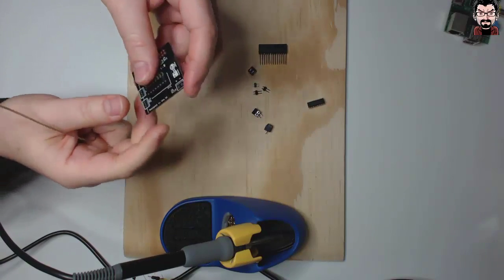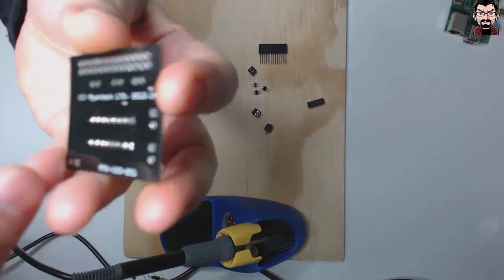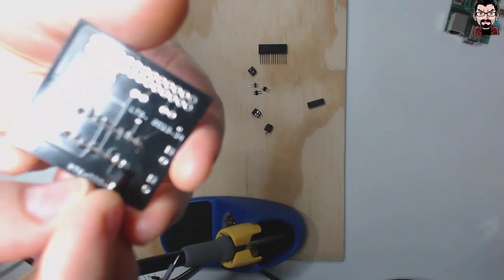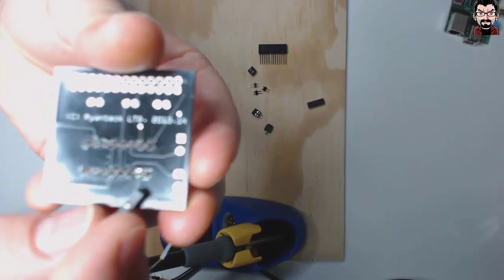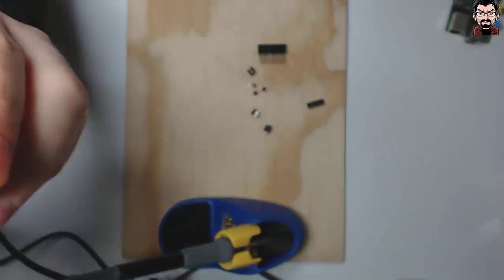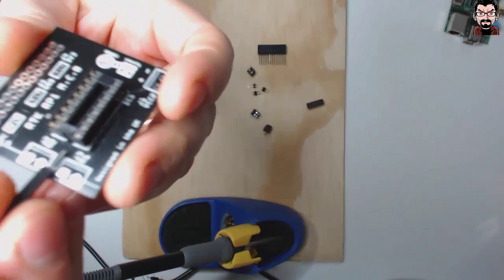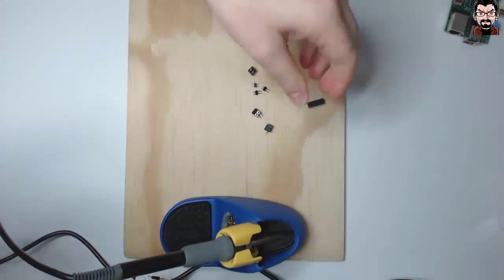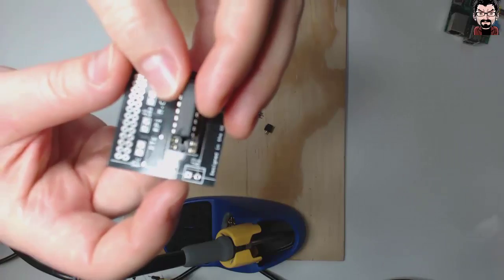And just so that there are no doubts about how to put the socket in the right orientation, pin number 1 is the squared one there. Then we have to make sure that this indentation here on the socket corresponds to the indentation of the silk up here. Once the indentation corresponds, then we're sure that pin 1 is in the right place, and it is the same indentation that we'll have to follow when placing the IC directly onto the socket.